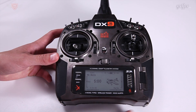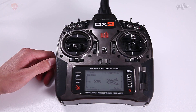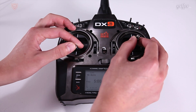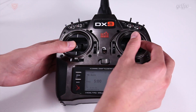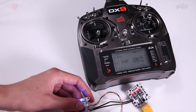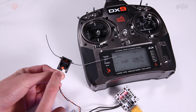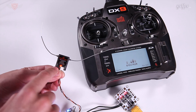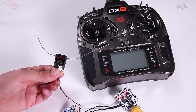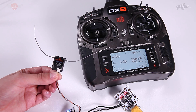Once you have it bound, let's move over to the Betaflight configurator for a closer look at how to set it up on the computer. But before that, one thing I forgot to mention: if you go and fetch the receiver again, you'll see that the light stays a bright orange color - that means the binding has been successful. If you switch the radio off, that light will go off, and when you switch it back on the light will come back on, meaning you are bound and ready to go.